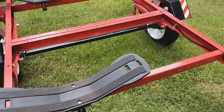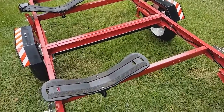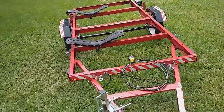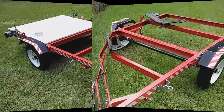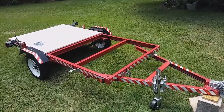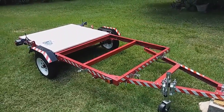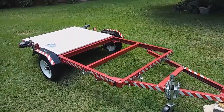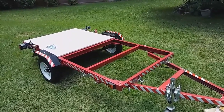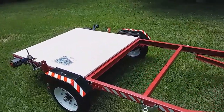The wings can swing out wider if needed — put two on the sides or one in the middle for a big kayak. Now for a couple of pointers if you're going to put down plywood decking: use 3/4-inch pressure-treated plywood, standard 4x8 sheet from Lowe's for about $35–$40. Before you leave the store, have them cut it in half — they've got a big saw that'll make a much cleaner cut than a circular saw.